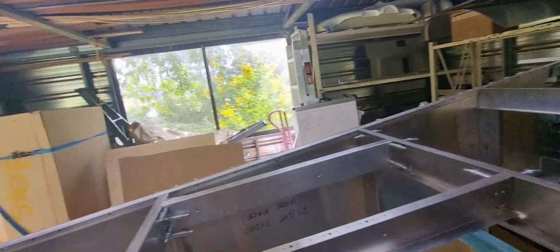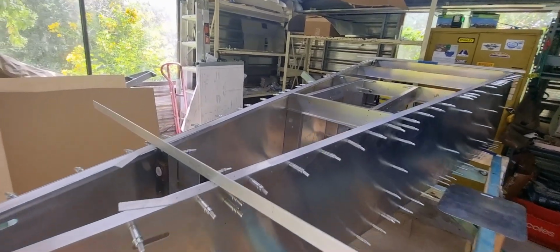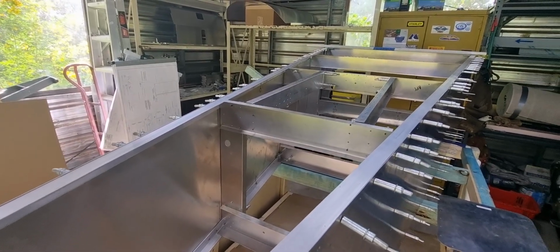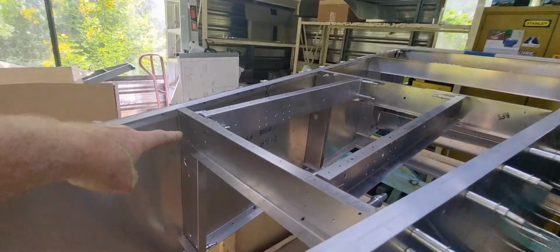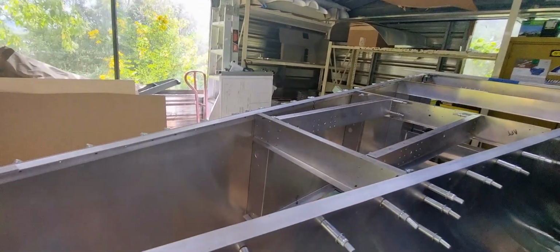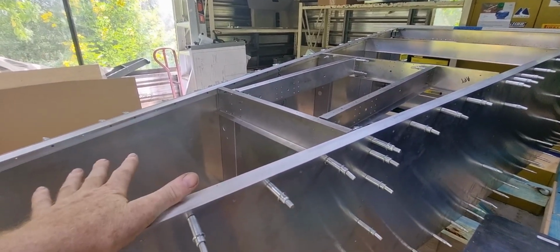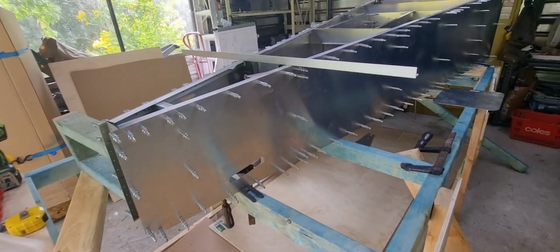Whether I do the skin now, I probably am not, only because I think at this stage I might upsize all of the cross ties and the formers all the way through on the rivets through here only at this stage. That'll free me up some silver clecos. Then once that's done, I can lay the underside sheet onto here, cut all this access panel out, drill the silver clecos on the underside sheet, and then probably start looking at upsizing all the sides. I think that's probably the way to go, but at the moment it's going to remain in the jig.